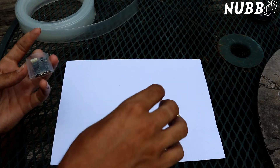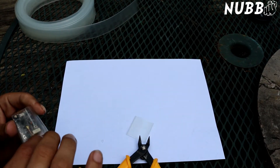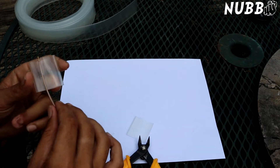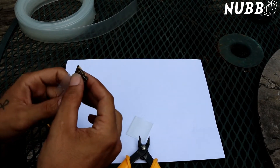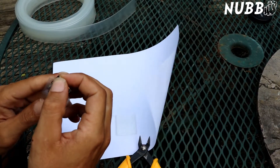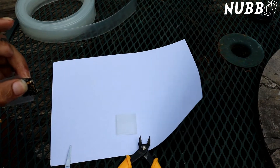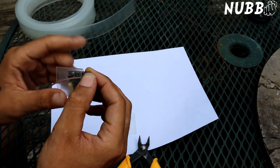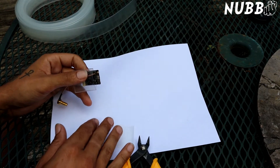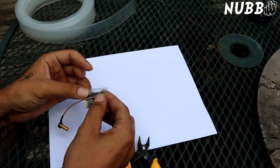Now this way, if you need to shorten your SMA pigtail — say it's a little too long for your build, or if you want your Unify turned around in a different direction — you just take your SMA and slide it through this hole. Take your Unify and get it up in line for the heat shrink. Any time you put this U.FL on there, make sure that you have it very lined up. You don't want to mess up the pin that's in there. Get it straight and then make sure you can hear an audible click whenever you push it on. Then slide your Unify in, line up the back, and heat shrink it.